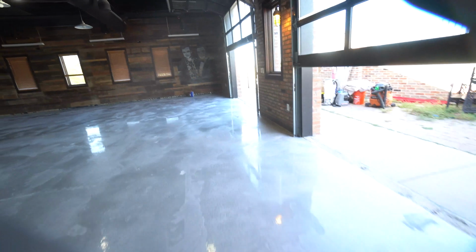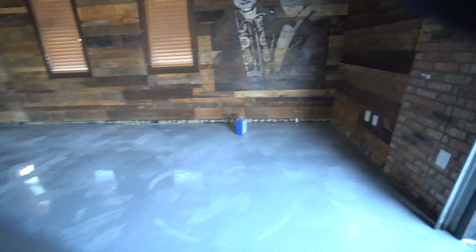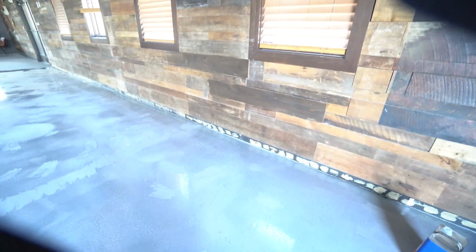I'm just going to walk you through and show what all we've done here. You can see all these repairs, all of this work. Everything is clean now. The baseboards are off, which helps a lot, because when the baseboards are off, we can roll right up against that. It makes it a lot easier to do the final coat. These areas, like that little crack, will all be covered with the cove base they'll put on, probably a commercial cove base, some kind of poly.